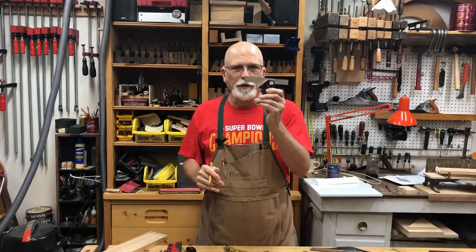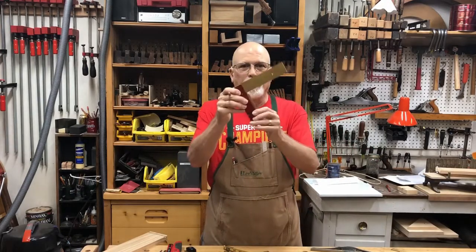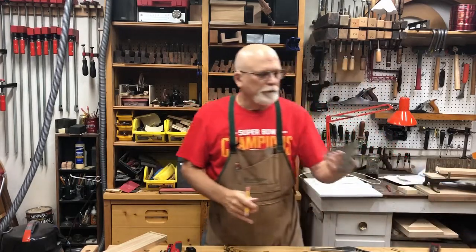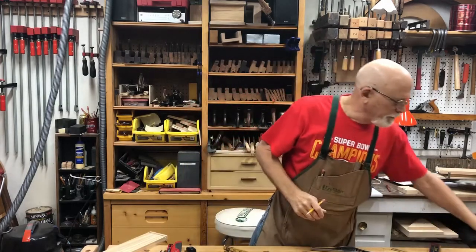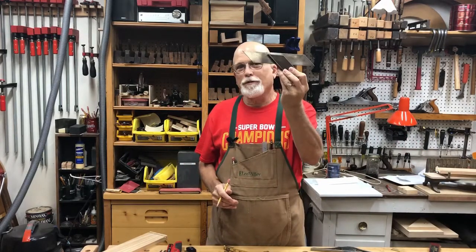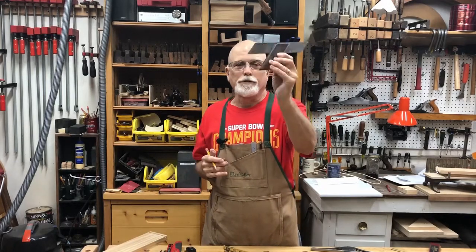They come in different sizes — this is a little one with a six-inch ruler, they come with a 12-inch ruler, and you can get even bigger. This is a square that's not adjustable but it's at a perfect 90 degrees — here's a modern version, and here's a more antique version. Again, 90 degrees, but this part right here is 45. This dedicated 45-degree square is an antique but it's right on the money as far as being at 45/45. I use it a lot anytime I'm marking miters.